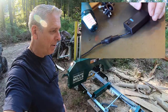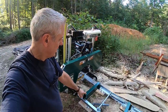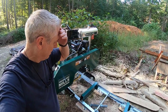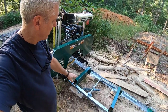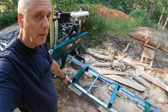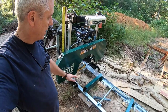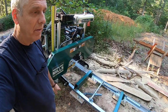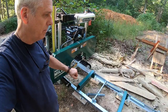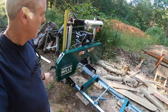I really like it. I'm happy with it. Makes a big difference. In fact, this clamp that holds your board in place, I check when I know the blade's getting down low and I'm concerned it might be too low. And in fact, I did it today. I flipped the laser on and I could see that it was just going to go above the top of the clamp, so I adjusted and moved the clamp down lower. I wanted that 3/4 inch buffer zone.